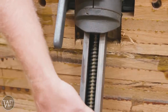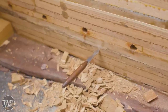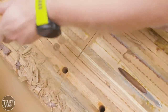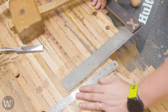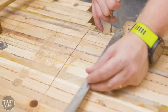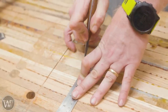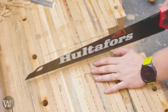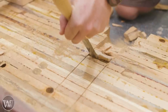Now that it mostly fits, I need to cut a slot all the way back for the screw - about an inch deep into the back, all the way across. I'm going to use a saw to cut across the grain and get relatively close, then come in and remove the waste with a chisel. I want to make sure this is going straight back from the edge, so I mark out both sides and cut in between, which makes it easier to pop out those chips. I'm cutting at a diagonal - down as far as I can in the front, then back as far as I can on the other side - so the first few chips go almost to full depth but it tapers back.